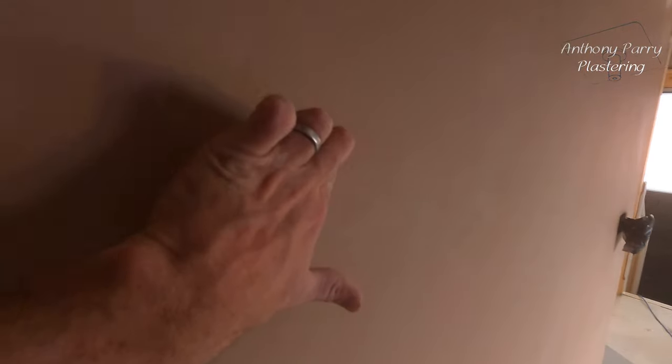It goes off a lot quicker. I then go on to my super flex trowel and finish it off with the easy skim. Trying out plastic trowels this year has made a massive difference to me — to the actual finish. I think painters are going to be a lot happier than with my steel trowel. It just gives a lovely matte, super smooth finish.